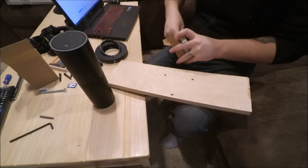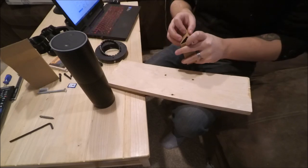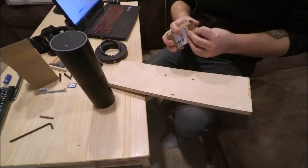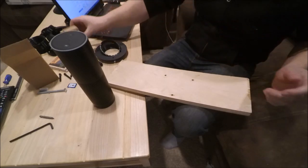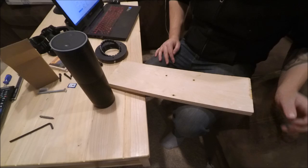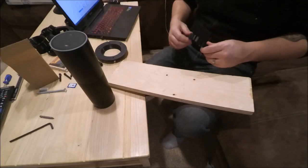These are the best option for going into a ceiling. If you choose to go into a wall, then your best option will be the drywall wall anchors, and get the ones with a number 8 screw. There's ones with number 6 screws, but number 8 screws will work really well, and then you can pick up just 3/16ths regular washers. You can get all those at Lowe's or Home Depot. But in the ceiling, the carriage bolts are going to work the best.